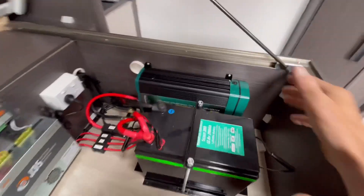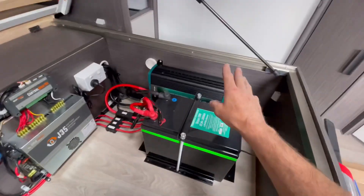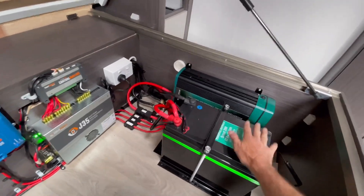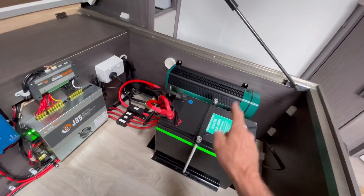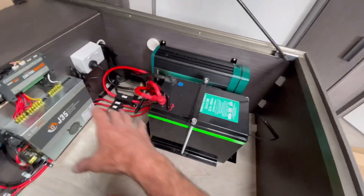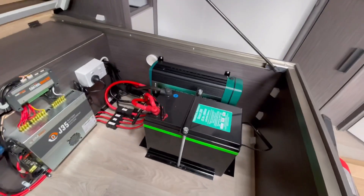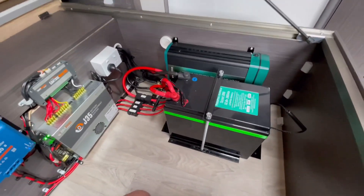This is a single lithium battery — check it out — a 280 amp Power Pulse Scout. This is a custom-made Australian lithium battery and I'm absolutely loving these. They have a continuous discharge of 250 amps, which means this can run a 3000 watt inverter from a single unit. You don't have to put double batteries in anymore.